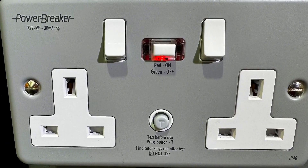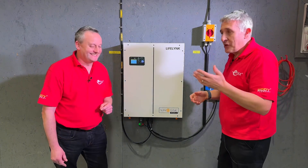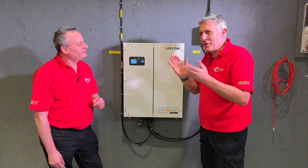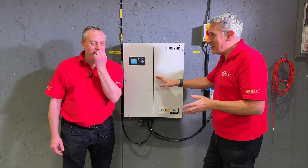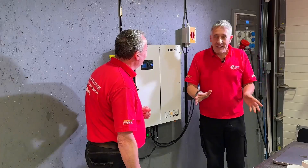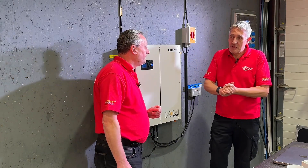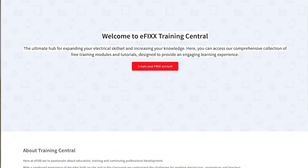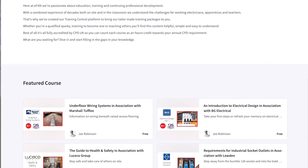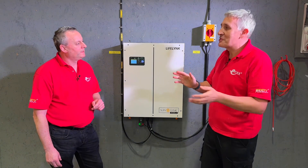Or if you're off-grid, that's where you'd connect your loads to get power from the battery. We've pulled it out here to this RCD socket. Now, there are quite a few complications when it comes to the electrical requirements for running stuff on the UPS side. And it normally comes down to something called the Earth Bond Relay, which is built in — luckily — on this one. We're not going to go into the electrical side in this video because Joe Hammond has produced a fantastic CPD, available either publicly or on eFix Trainer Central, where you can learn all about the essential electrical installation requirements for things like island mode.